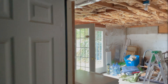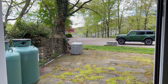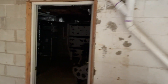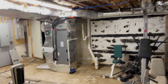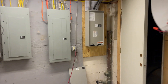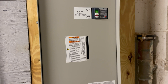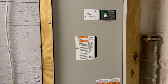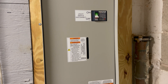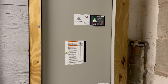All the lights are off. The generator just kicked on — you can hear it. In about 10 more seconds it'll detect and switch, and as you can see it just switched to generator power. You may have heard it — there's a kind of a large bang sound when the main solenoid switches over to the generator.